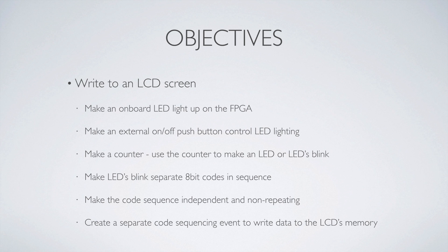In this case, I had a temperature sensor and I was controlling some fans and some Peltier cooling pumps and I wanted to be able to display on the LCD what was going on with those things. That's going to come from the memory, so it's kind of an independent process — each time it went through, it'd have to put out a different code. Then we'll create a separate code sequencing event to write data to the LCD's memory. You can't just throw the actual character codes at it — there are certain sequences of events that have to take place. I'm not sure how deep I get into that in this presentation, but it's all covered in the data sheet, which I will go over during this video.